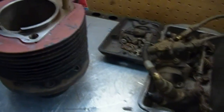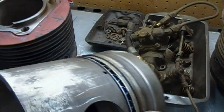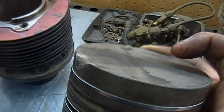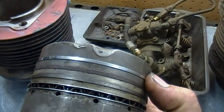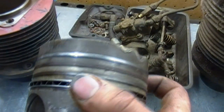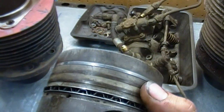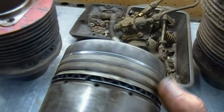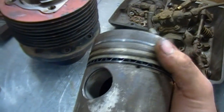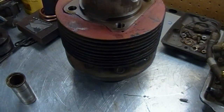As far as the piston goes, I'll just have to file it concentric again. That dent's just gonna have to be there, but I don't think it'll really affect anything. You can see the rings — top ring looks perfectly fine, a little bit of pitting on the center ring and on the lower compression ring, but they'll clean up just fine. The oil ring's okay, nothing's cracked. They are all stuck in their grooves, but I can get them out. That'll be alright.